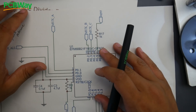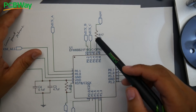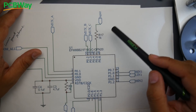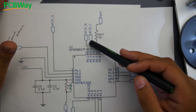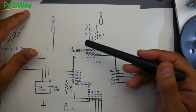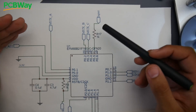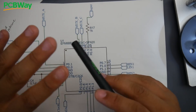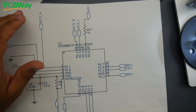Now let's look at the MUX side of the BB2 chip — consider these the eyes of the microcontroller unit. When the motor is spinning, it also generates voltage, essentially acting as a generator. So even if phase C is off, the spinning motor sends an electrical signal back. The MCU sees that signal and knows when to switch phases. This is how sensorless ESCs work — there's no physical sensor, so the MCU calculates position through the back-EMF voltage coming back from the motor, all handled in software.